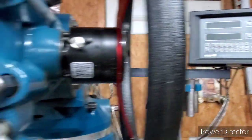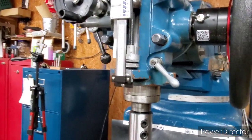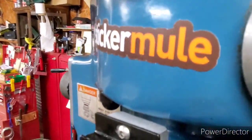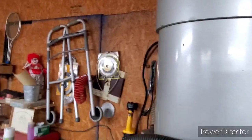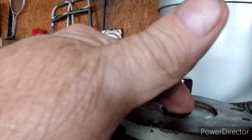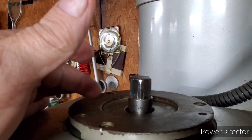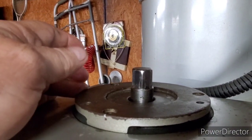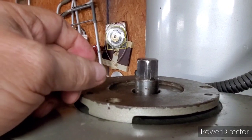The mill is running and it really surprised me how quiet it is. It was pretty noisy when I first started it up and I found this by accident — there's a bearing right here in the plate that the power drawbar hooks to. I took it off and just messing with it, happened to turn the bearing and it was pretty sticky — it turned freely and then it hung up. I happened to have another bearing that size, put it in there, and it made a hundred percent difference. I just found it by accident; I wasn't looking for it.